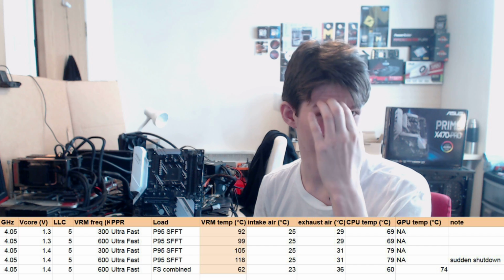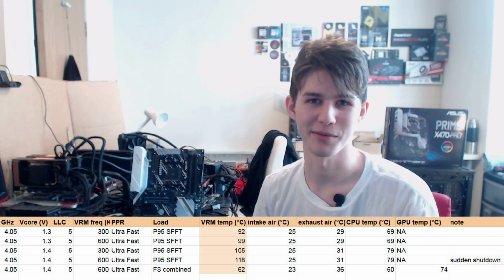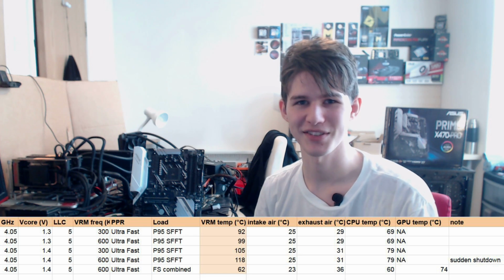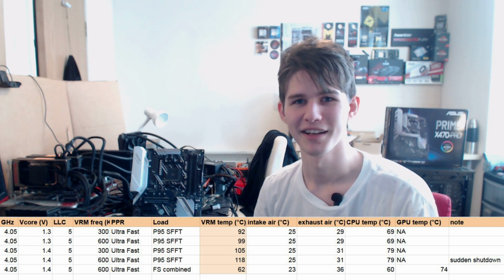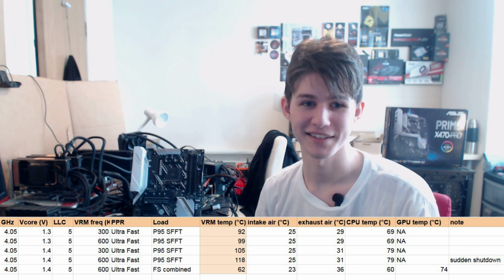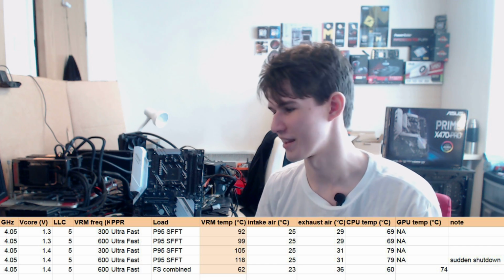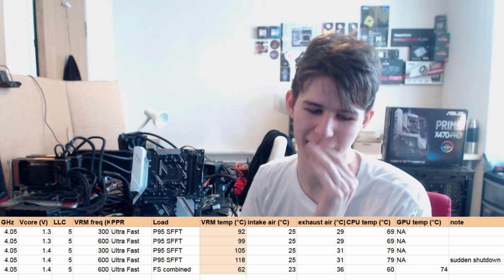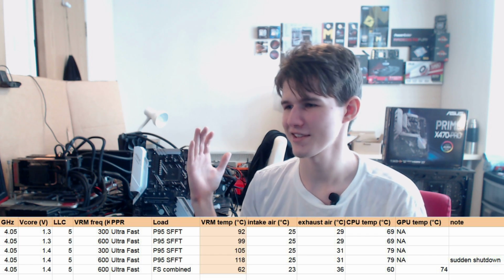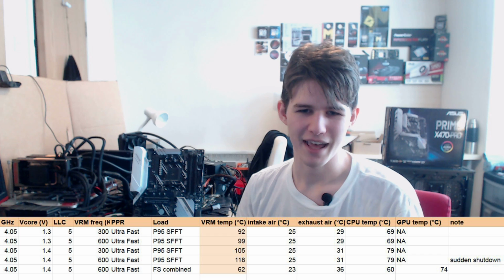I already mentioned that in the some thoughts on X470 motherboards video, where I'm like, does the 4-phase ASUS X470 Tough board have to be so bad? Because this is actually a decent VRM, and it's still not doing that great. So that's going to be a catastrophe. Now I want to test that board because I'll be like, oh, look, it does 130 at 1.3 volts or whatever. So yeah, that's it for the video.